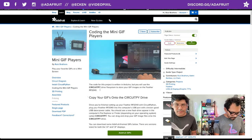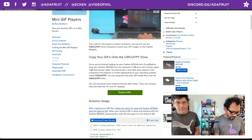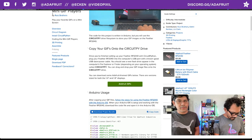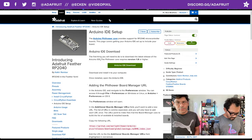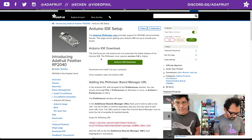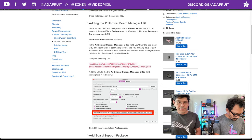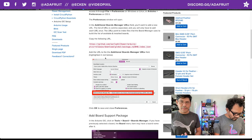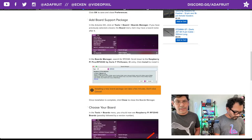All right, next up, you'll want to get your Arduino set up. So we have a link here on setting up your Feather RP2040 with Arduino. There's a dedicated page. We're using the Earle Philhower core for Arduino, so you want to install the board profile for those. It is all documented here. You'll want to take a moment to get this all set up. If you haven't done any Arduino on your Feather RP2040, this whole page will just walk you through all the things you need to do in order to get your boards manager, the Raspberry Pi Pico RP2040 stuff.